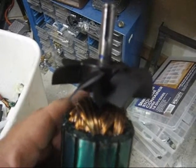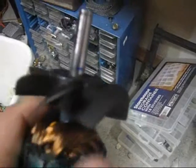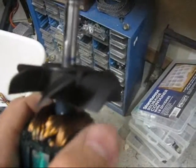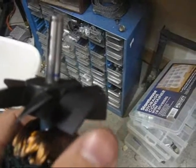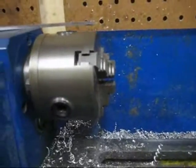This is an 80-millimeter fan from a computer. I've pulled it off the motor and basically just gotten the fan blades off, and I've trimmed the edges down. The way I did that was mounting it on my mini-lathe and using a file to just file the blades down. It was dusty work, but it eventually got it done.